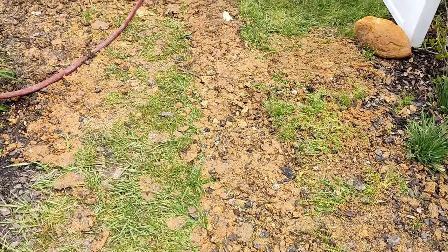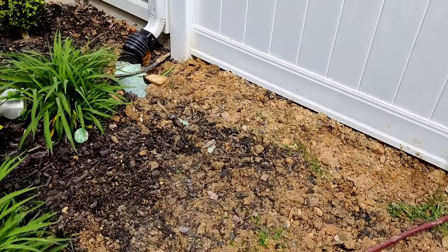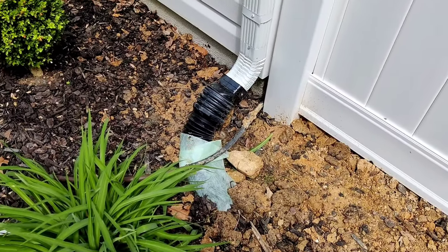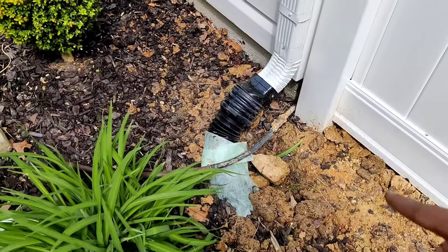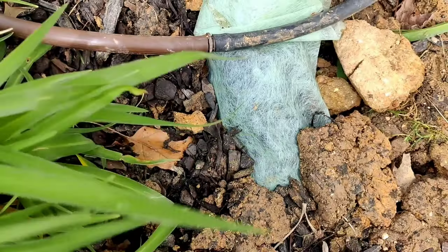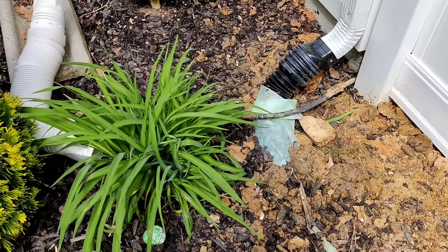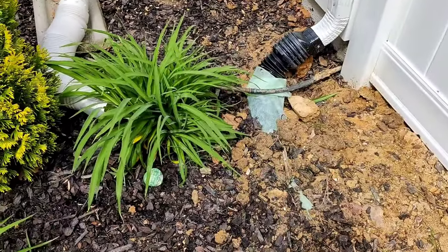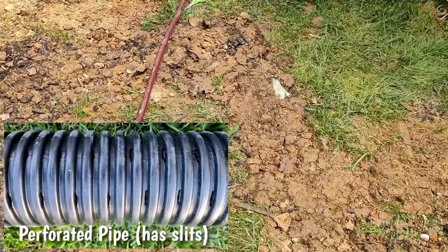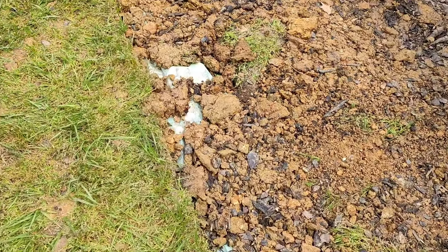I'm pretty much done with the French drain portion of this drainage system. Here's my gutter — from the bottom of the gutter I attached an extension and popped in two screws on each side to make sure it's secured nice and tight so it doesn't pop off. From the bottom of that I attached the perforated corrugated pipe, and I popped in a screw there to make sure that's secured tight as well. This pipe running across here is my drip system, so I made sure to leave that accessible in case I need to change how it's routed. All of this will be mulched so you won't see any of that. All of the perforated pipe is wrapped in rock as well as fabric — the fabric keeps the dirt out of the system.